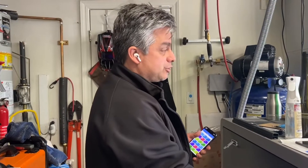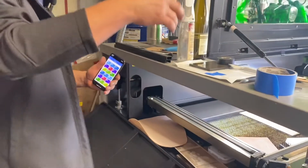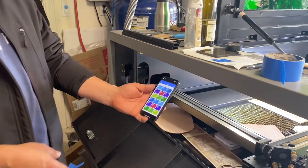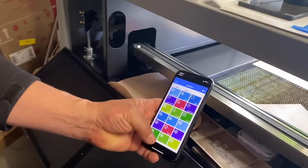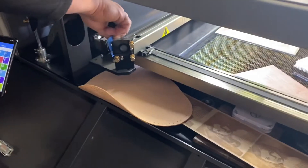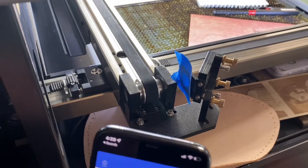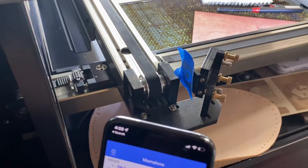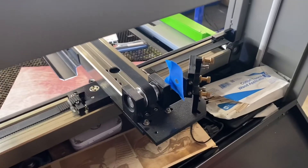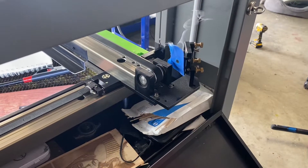Let me give you a quick demonstration on how to do the mirror calibration with your app, so that you don't have to be running around to move the axis or to set the poles. What I'm going to do right now is move the Y axis and set the tape from the mirror. I'm going to send a pulse to check right there, then move the laser to the other side all the way down, and I'm going to send the pulse to check — and it's perfect.